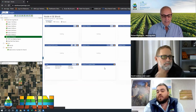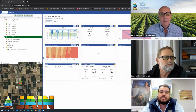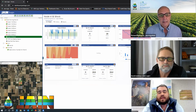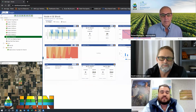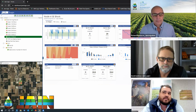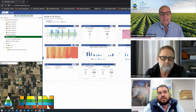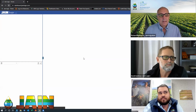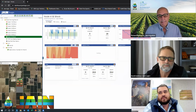Yeah, and in water management services, we take the time to understand what MUs mean, because every field's so different. We have to take the time to actually auger down and check the soil moisture with a hand field method test. That way we can understand what MU means in that field off the probe data. Every season, at the beginning of irrigation, I go out there and we figure out where we're at compared to the MU chart and understand what it means. Then I come back to the office and say, okay, we were at 65% moisture out there and we were at 46 MUs at the depth.